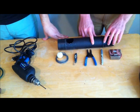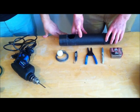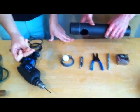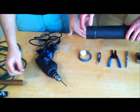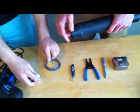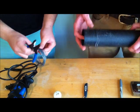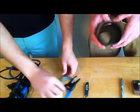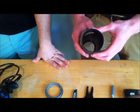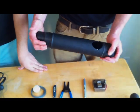Once we did that, we had to make sure the balls wouldn't go back into the fin apparatus in the leaf blower. So we took our drill again with a smaller bit and drilled approximately four holes around the outside of our barrel. Then we took our wire along with our wire cutters, cut off short extensions of wire, and made a mesh backstop so the balls wouldn't go into the back of our barrel. That's the basics between our leaf blower and our barrel assembly.